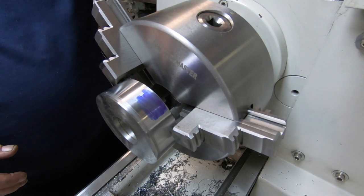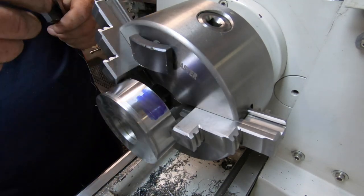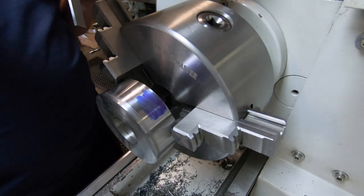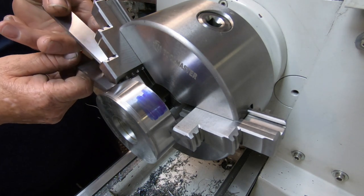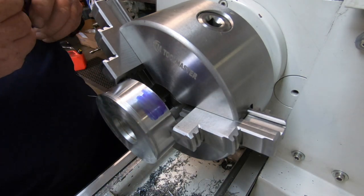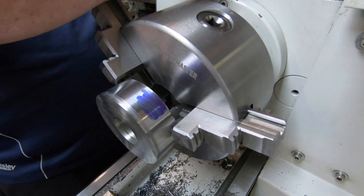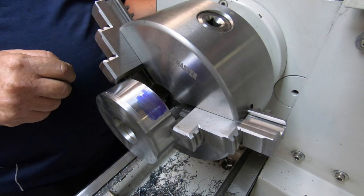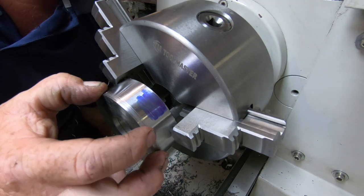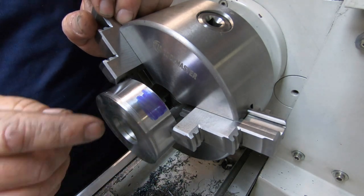Okay, what I've done here is, again, used a couple of magnets on the chuck. Covered in a bit of swarf now, but anyway, they held the parallels in there. Two parallels against the face. Done the chuck up, slight little tap. Eventually got the parallels back out, and it's running pretty true. Oh, this magnet. Pain in the ass. You can see I've scribed a line here. As well as this excess material, it has to come off. So I'm not going to bore you with getting rid of all that. I'll just gnaw away at it, and then I'll bring this back when that's done.